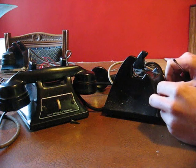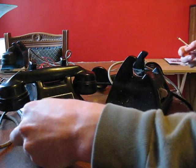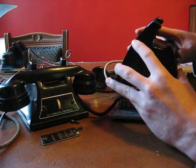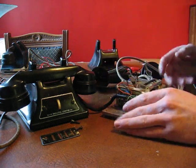These run off six volts — just batteries, basically. All six volts are used for signalling, and one and a half volts from one cell in the six-volt battery is used for powering the speech circuit.